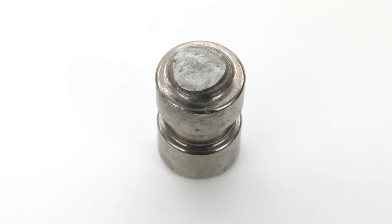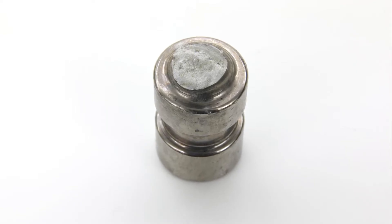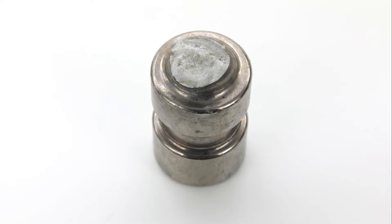A shear pin's purpose is to protect the drive assembly. Causes of shear pin failure can be abrupt or chronic. Abrupt cases like foreign objects in the tank are often obvious and don't require much investigation. These instances leave a telltale mark on the pin. Notice how this pin's surface has a clean shear smear from overload failure. More challenging failures cause the shear pin to break via fatigue. These are small events that create tension pulses in the system, gradually putting cyclic stresses on the shear pin until it breaks.